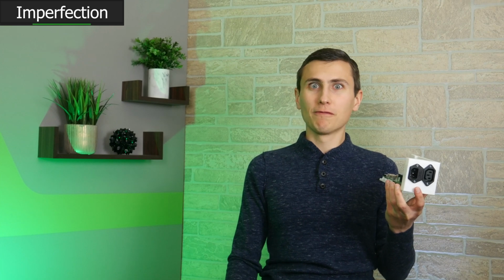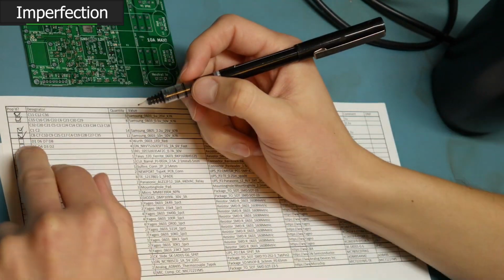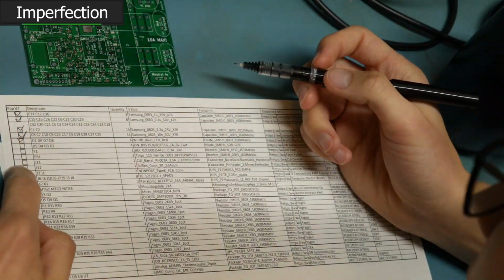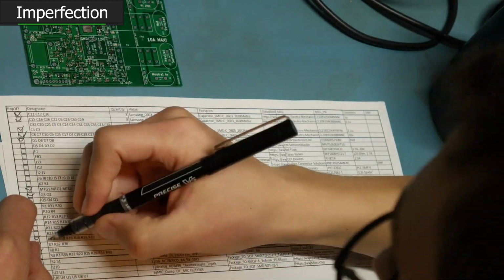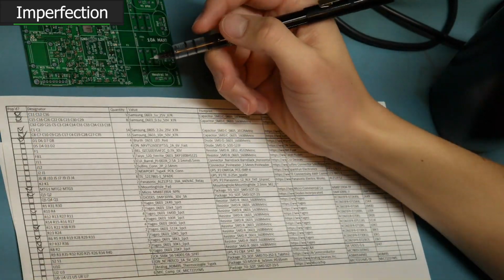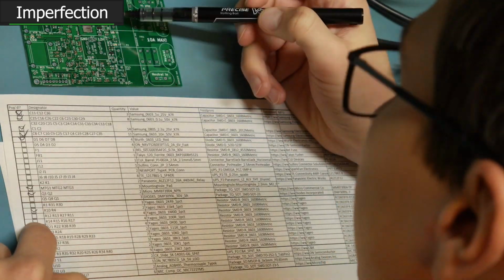Technically, I suppose we could use a bunch of these, just take one, copy it, make like 14 of them, and just put a thermocouple everywhere that there could possibly be an ignition source. I could take 15 of these boards, wire up all those thermocouples to different points in the printer. Well, but that's just not really the point. The point of this project is not to attack every single opportunity of fire, every little bit of risk, but it's meant to attack the most probable points of failure. Specifically, this temperature monitor is meant to attack the points of failure that are most likely to occur while printing.